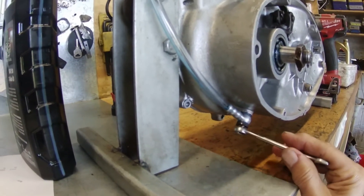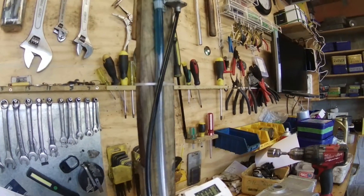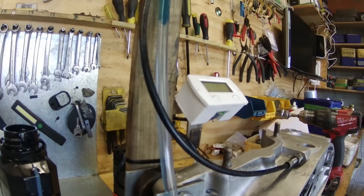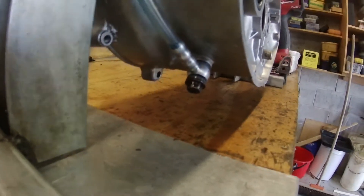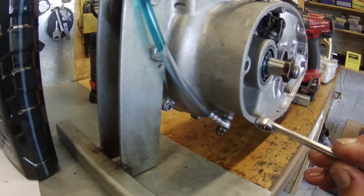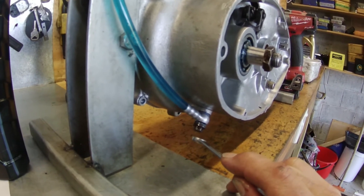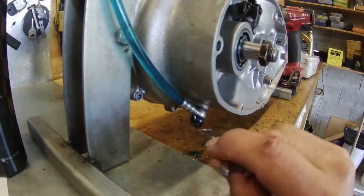As you can see, it's really important to bleed the oil line. So we're doing that now — I'm just opening it up, and as soon as I do that the oil starts flowing down the pipe. Just watch that now, it doesn't take too long. Once it's reached the bottom of the pipe it will come out of the screw, and then we'll close it. That's about 30 centimetres away now, just arriving slowly, and it's starting to come out now. I'll close that.